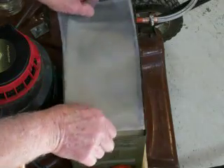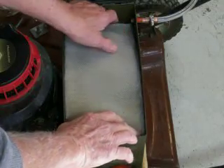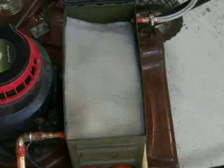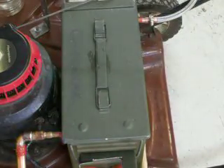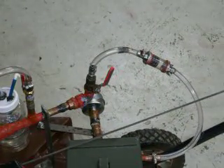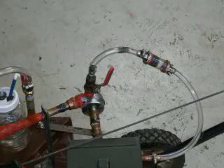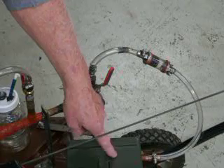This screen acts as a backflash arrester. Over here is another backflash arrester — three little pieces of screen. So if it ever did backflash or backfire, it would snuff it out here. And if it ever did get through to it, that would snuff it out too.